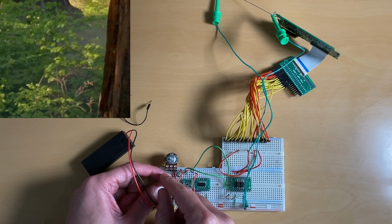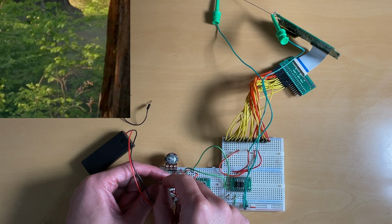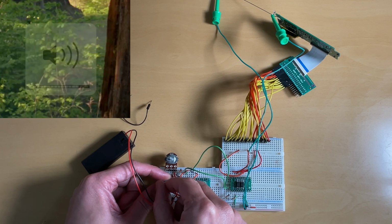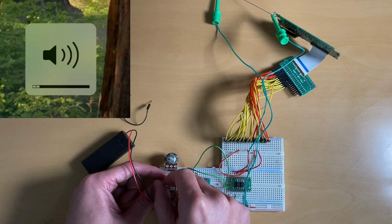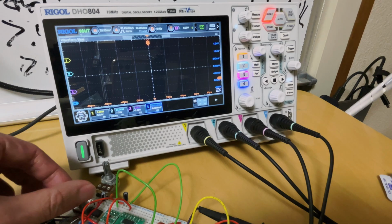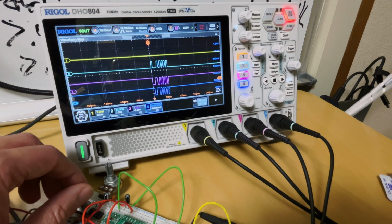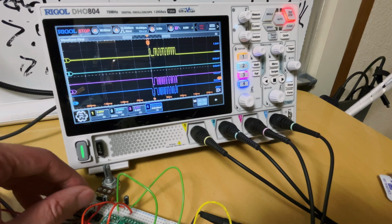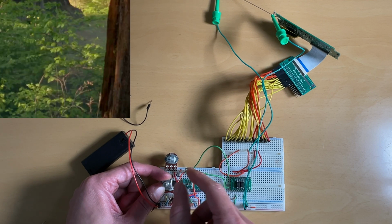Anyway, another really big advantage of moving to an Arduino is that in the last video, with a purely non-MCU circuit, I was about to add one big disclaimer, and that was a limitation of the K380 PCB. If we're using key inputs to run the encoder, we're limited by how fast the K380 can trigger the key presses and have our computer register them. So going back to the trigger pulses we were getting from our encoder from our final circuit, we were getting them all and closing and opening our photocoupler fast enough, but is it too fast for the K380 to be creating those key presses? Short answer, no. And yes.